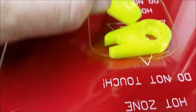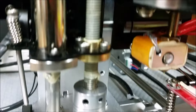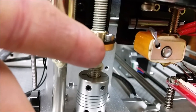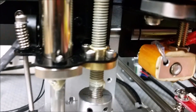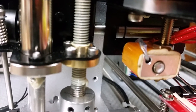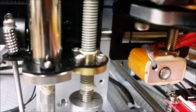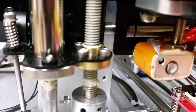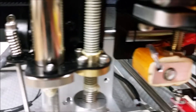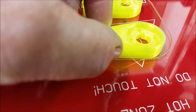Anyway, hopefully these will take care of it. What I'm going to do — the nuts that are on this carriage — I'm going to take that loose. That'll bolt into the new plastic piece. And that way the carriage will actually sit right on top of the new plastic pieces so that the wobble from the threaded rod won't transfer to the carriage. It'll help reduce some of the wobble.